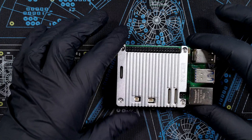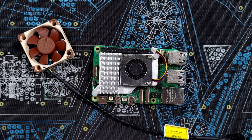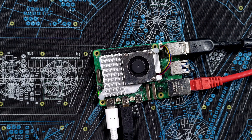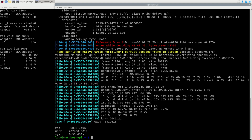I find it hard to believe it's supposed to be used just like this, so I actually want to fire it up and see how it performs. But first, I've already run one performance test — right before removing the active cooler I ran one of my favorite CPU tests: downscaling the Big Buck Bunny movie from native to Full HD. It did it in just over an hour, and the temperature held pretty much constantly around 65°C, with the maximum being 67.8°C. I'll use that as a baseline for comparing the performance of different coolers.